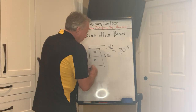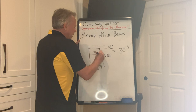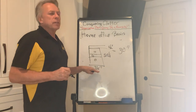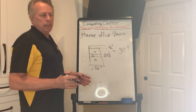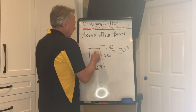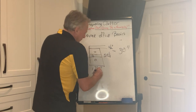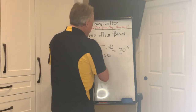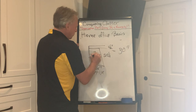A letter file is pretty common. The overall dimension of a letter cabinet is 17 and a half inches wide, with 16 inches on the inside — use 17 and a half when laying out, but know the inside is 16 inches so you can get the proper file hangers needed. For legal, it's 18 inches wide inside and 19 and a half inches overall.